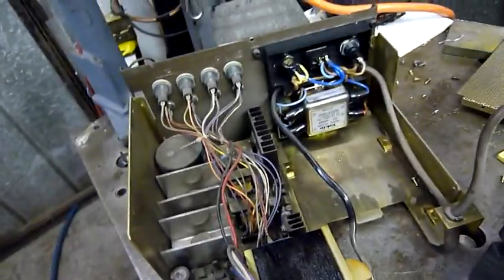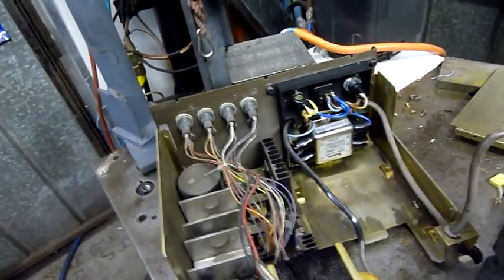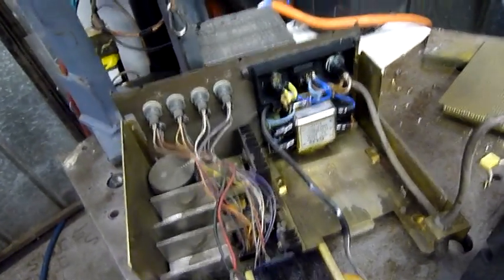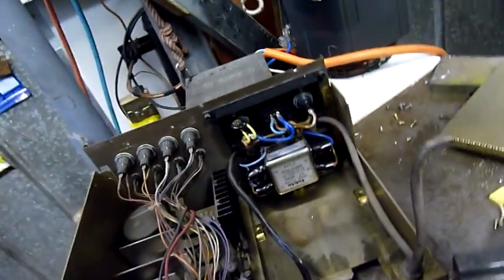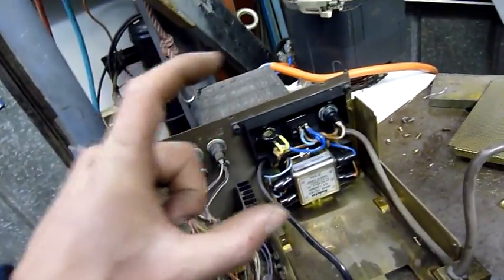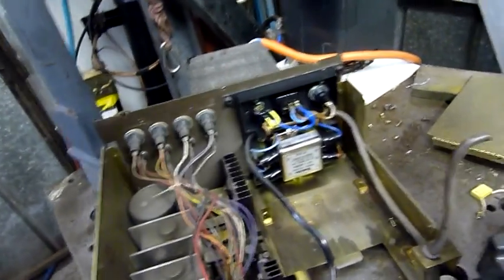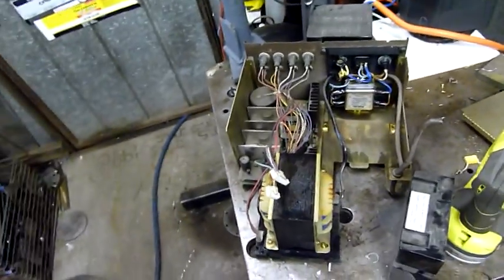All I can do is let it all dry out thoroughly and give it a test run one day. I'll run it without earth and with proper safety precautions, of course. Isolate it and measure to ground and just see if I'm getting any voltage. If there is voltage, it could be a breakdown inside the noise filter or something like that. I've got a few different noise filters, not like that one, but similar small modular boards out of plasma TVs. Same deal, just not inside a metal can. So I could replace that, and this thing can be a nicely filtered power supply.